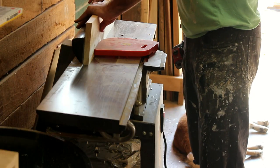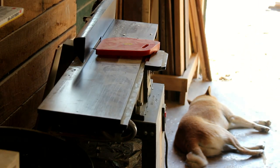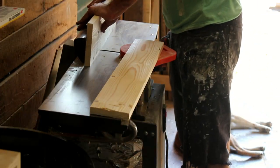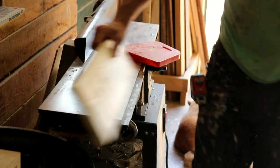I didn't show it in the video, but I did actually use a straightening sled to get a nice straight edge on these boards. It makes it super quick and easy, and they're super easy to make yourself. You can also use a jointer for this process, but you have to be careful — once you use the jointer, make sure that edge is perfectly straight and square with your end that you just cut to length. If you're going to use a jointer, maybe cut them a little bit longer than twenty-eight and a half to start, straighten your boards out, then cut them to their final length. After you use the jointer, flip it over and take it to your table saw to cut the other side perfectly straight and parallel.